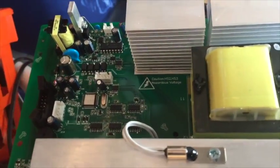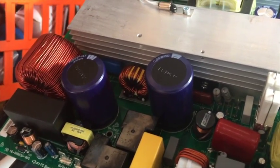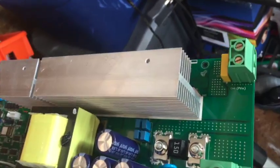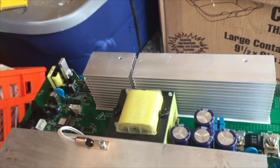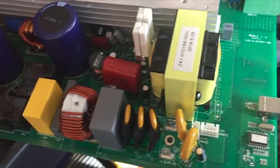Looking at the replacement board — very clean and well-designed; it doesn't look like it was an afterthought. That's where the monitoring boards hook up, and as you can see there are no inline shunts, which is why the readings are inaccurate — it likely measures resistance to estimate current. On the charge controller side, you can see the radiating fins and heat dissipation on the side, and capacitors that help regulate the output voltage.